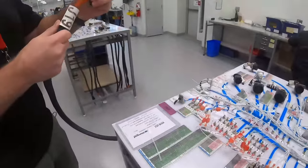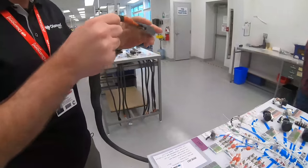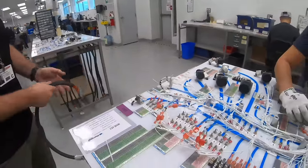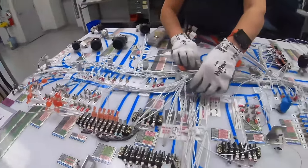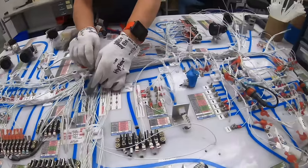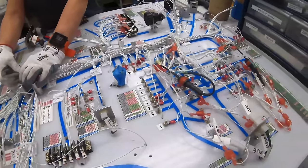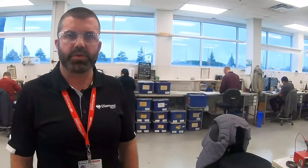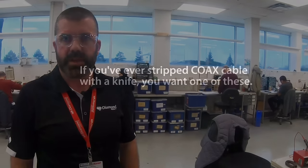Once it is crimped on the board, it is terminated, and then it is hooked up to a machine built by Cirrus, not the manufacturer Cirrus, but a cable tester, and every single wire on that board is then function checked and tested for continuity, for shorts, opens, to make sure that there are no miswires. So DA40 panel from start to finish for a builder sitting and building it himself, once he has the harnesses supplied to him, we can do it in about 23 hours for a fully trained person.